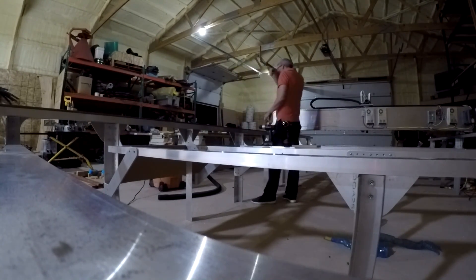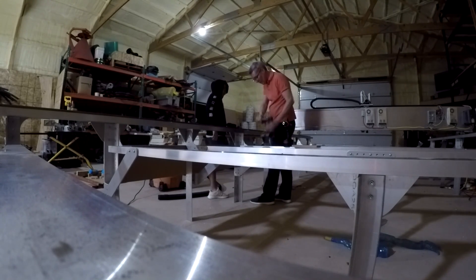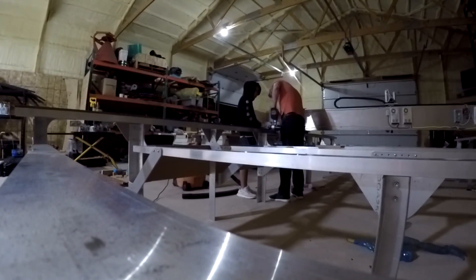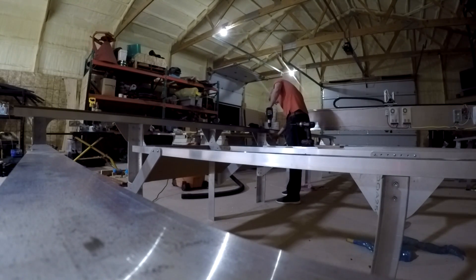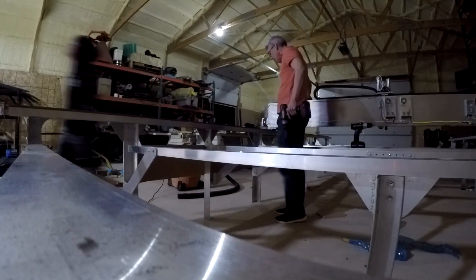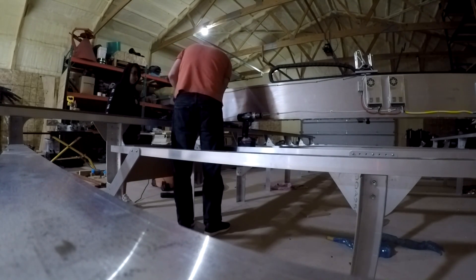The rails have a spacing of 60 millimeters per hole, and at the end there are 20 millimeters from the end and the beginning of the rail. That brings the hole count for mounting the rails on each side to about 100 holes and 100 fasteners — so there was a lot of work drilling 100 holes on each side. You can see here that I'm starting to move the gantry just to ensure the rail on the opposite side is correctly positioned and spaced so there's no strain on the bearings.